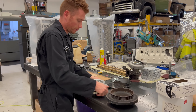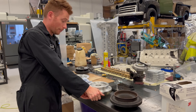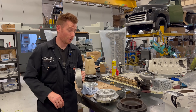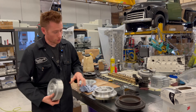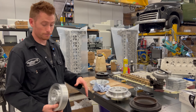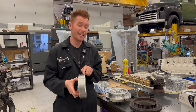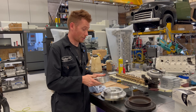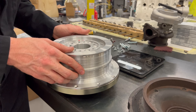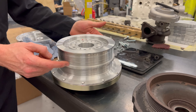The key feature, which will make sense very soon, is that when it's clamped down and done properly, this pulley has the ability to carry an additional pulley — so it's stackable. Currently we've got a 6PK 6-rib belt at standard diameter, the same as the other two. We can then stack it with an additional 10PK pulley on top, and you can put as many as you want on within reason.